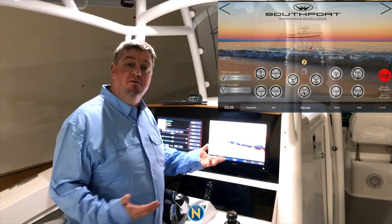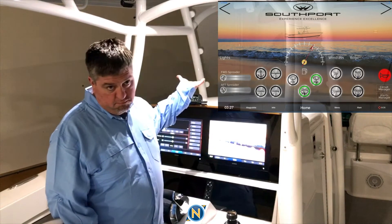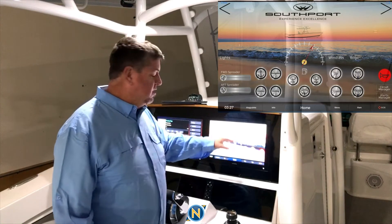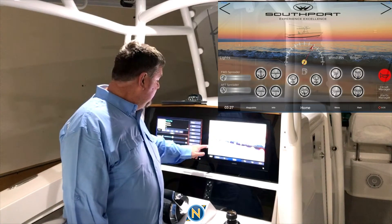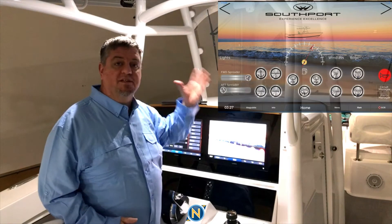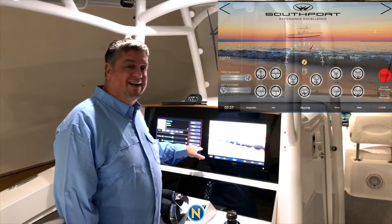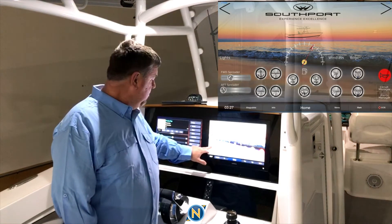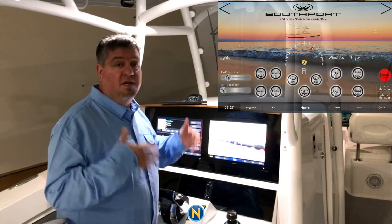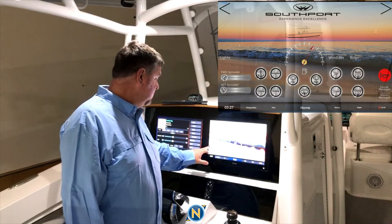Some of these things have logic to them — it's an 'if this then that' type of scenario. When we hit our washer button, the wiper kicks on, does a couple of passes, squirts water, and then goes back to the park position. There's no fumbling around for it. We also have our low setting and our high setting. This boat uses standard Lumetec Capri 2 lighting for the aft below the hardtop, spreader lighting for the front deck area and the aft deck area. We've designed in a slider control so we can dim down this light to whatever brightness we want — just enough so you're coming in at night and can work the lines, but you don't want to go blind because you're trying to see buoys, keeping that all-important situational awareness. There's nothing special with the lights; that's all done through the digital switching. It's very easy.